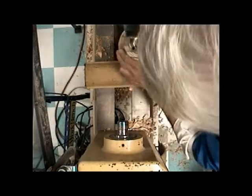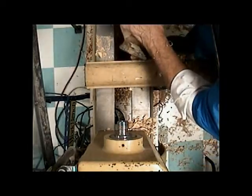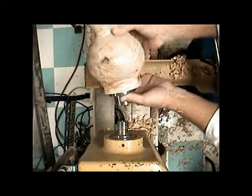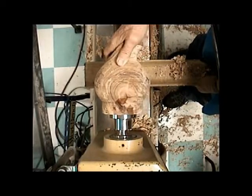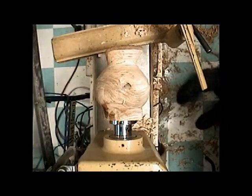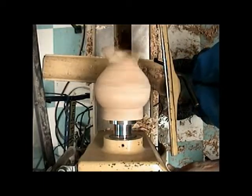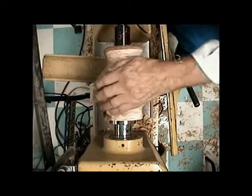Try and put all the screws in there, and remember to tighten up the one that you put in halfway. Once all screws are in, we'll screw it gently onto the spindle, get it started a little bit, then do most of the turning with the hand wheel to thread it right on there. I use one of the tommy bars, put the spindle lock on, and just tighten that up with a firm push — not a real hard push, but a firm push that locks it in place so that an equally firm pull will unlock it. If it's a little bit loose and you start turning it'll tighten on really tight and you won't be able to get it off.